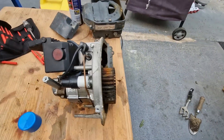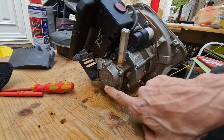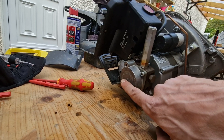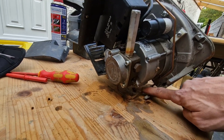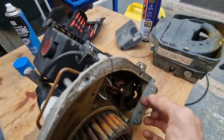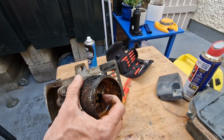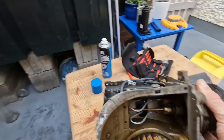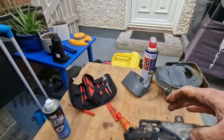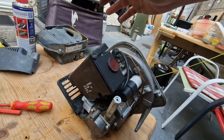This is your furnace — I have it taken out here, that's this unit over here. The furnace has one motor which on one side operates the pump. This is where the fuel goes in — that's the fuel pump — and it pressurizes this little thing which then squirts it out. That's the business end of the whole thing, and you have your spark ignition there, which this transformer creates a high voltage for.